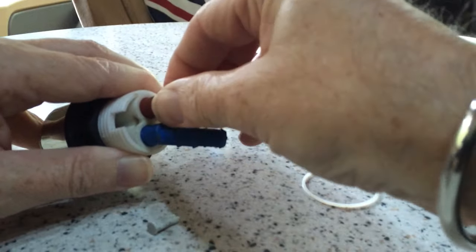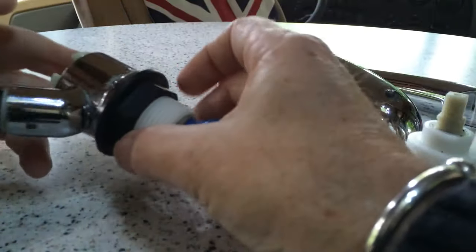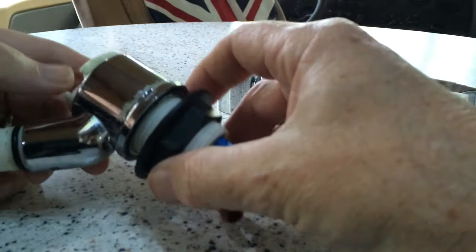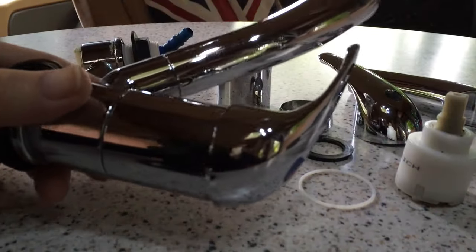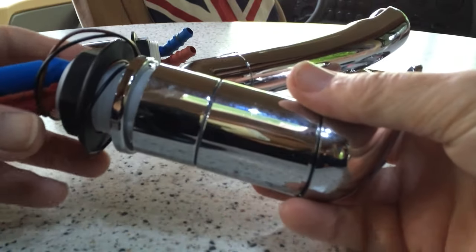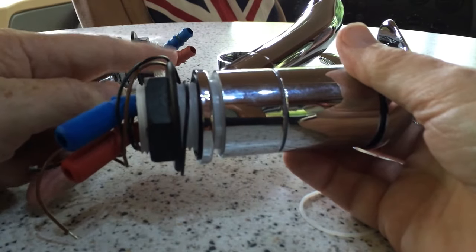To put it back, just push it well home and push the pin back in, which engages them in place. So that's really what you can do to fix a leaky tap. If you don't want all that maintenance, you can always buy a new one — something like sixty pounds on eBay, rather more through distributors. This new one here has smoothbore tails, which is a different type to the corrugated bore for ordinary pipes, but all the rest is the same.